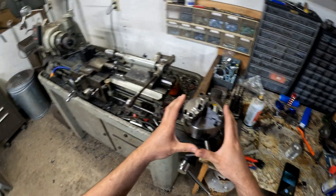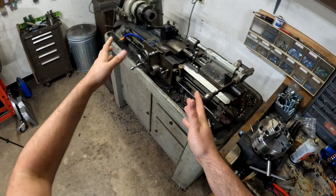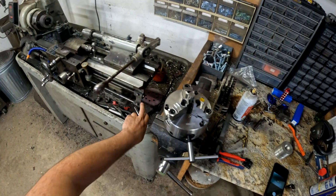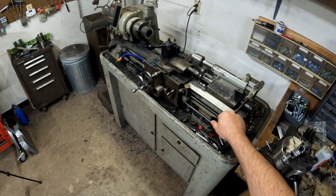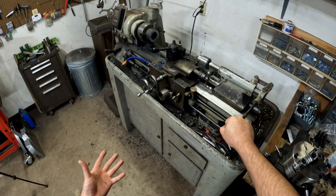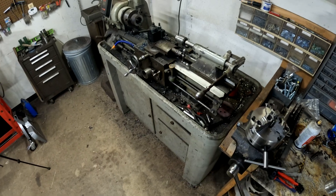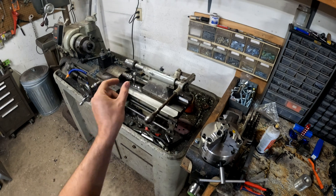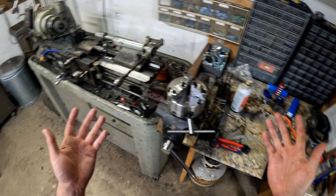That's what I want to do with this old lathe. The problem is this lathe is from the 1940s — based on the serial number, it was probably on a boat in a maintenance quarters during World War II, so it's a cool piece of history. But I still want to make high-quality parts on it, and I really need this chuck to fit on it. The problem is the spindle is 2 inches in diameter, 10 threads per inch, and they don't make back plates for that spindle size anymore.